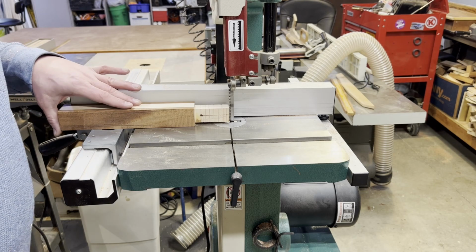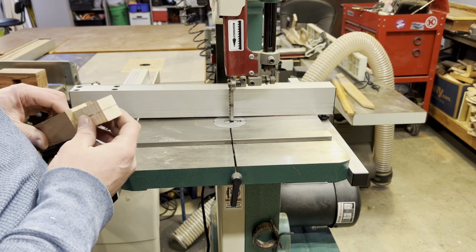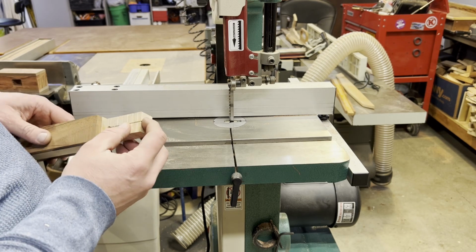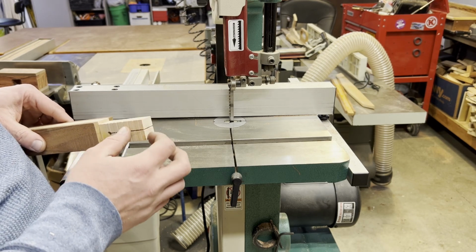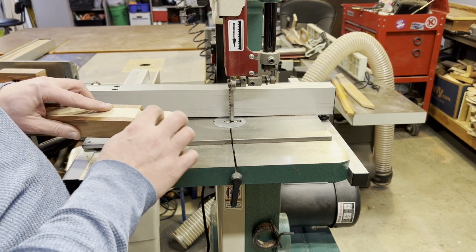Cut that one too much. The mortise cut the pencil line, but it'll still be okay. But I'm gonna split it a little bit. I think I'm gonna put a top wedge. Do a little wedge both ways, not all the way down.